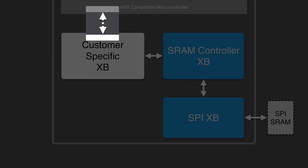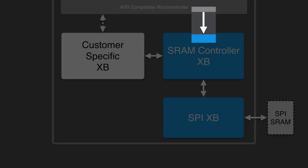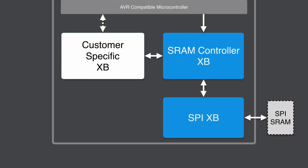As mentioned, there is probably going to be some kind of configuration here — though it doesn't have to be; configuration or real data may also come from off-chip. For the actual SPI SRAM controller XB, there is a small amount of configuration you can do through a register, but that's all. It's configuration only and is not used for any data transfer. From the perspective of how data goes out to the SPI SRAM, it's always connected in the FPGA logic fabric to some other accelerator block. There's no data interface to this SPI SRAM controller from the AVR — because if you want to write data that way, you might as well use the SPI that's part of the AVR subsystem.